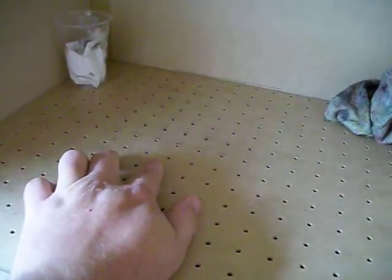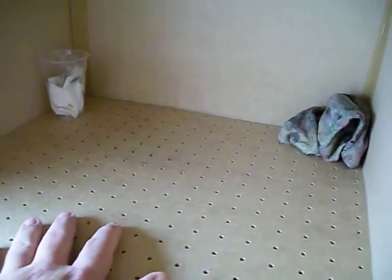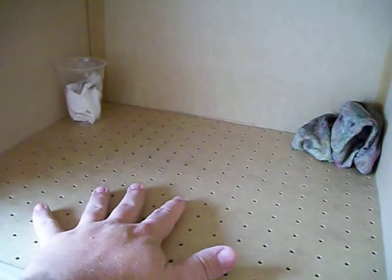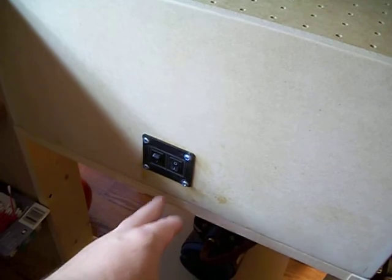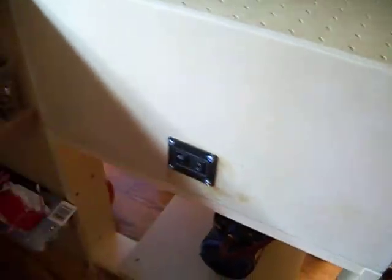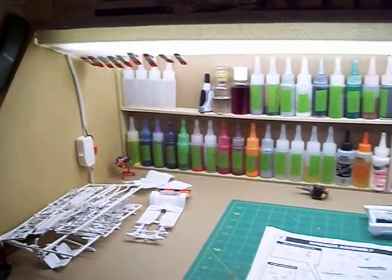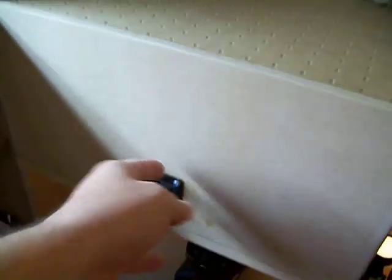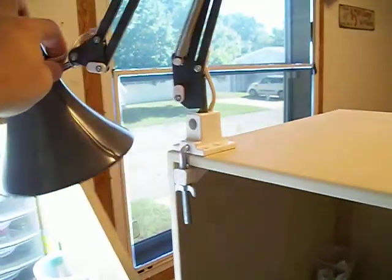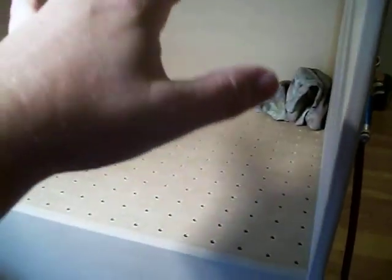You can already see I've got some black here. I sprayed just two or three little parts for the motor I'm working on, and when I pulled the pegboard back up I already had black all over the filter, so it really draws good. Here's my on/off switch — you can hear it running. This one is sealed with silicone as well. This side is going to be hooked up for the compressor, which is not done yet. This one's for the fan. The compressor I have running through this remote over here, which will turn the compressor on and off. For now I'm using a light that just swings around and shines in the booth. The booth is 16 by 20, and I believe this opening here is 14 inches.